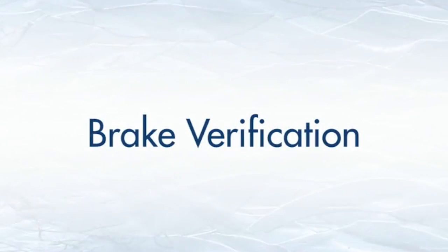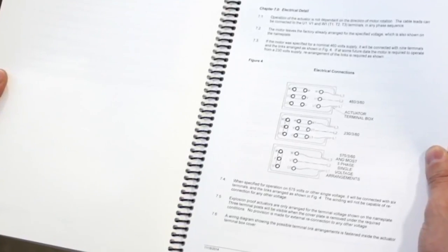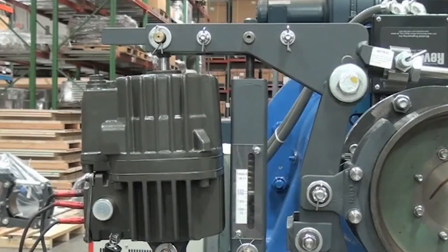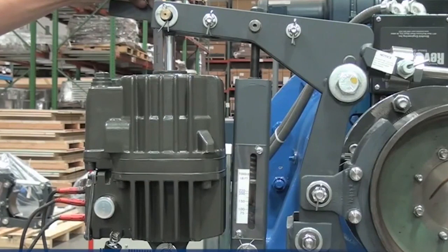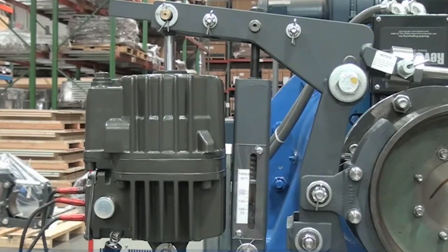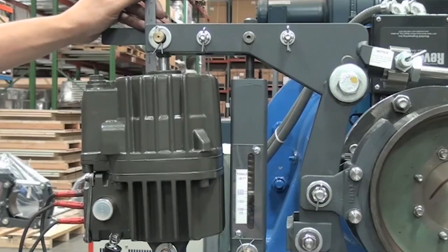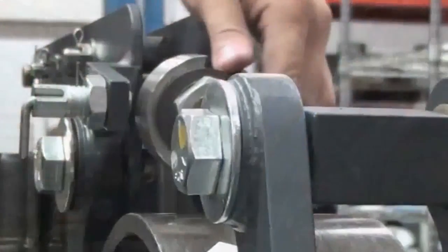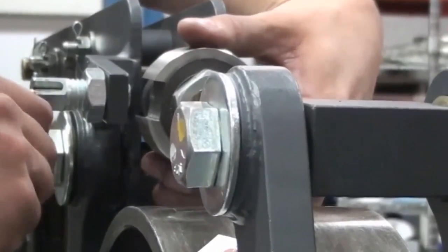To begin verification steps for proper operation of the brake, first consult the product manual for the appropriate electrical power connections. Apply power to the brake and allow it to fully extend and release. Be sure the brake has full range of motion and then measure the mag stroke. Remove power, allowing the brake to set, and measure the reserve stroke. This should match the measurements in the product manual. It is recommended that you allow the brake to set itself by alternating power on and off.